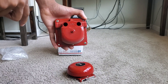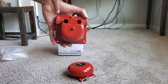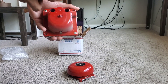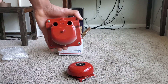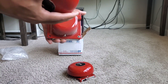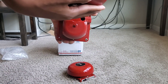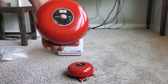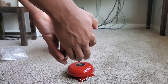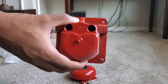The chime assemblies can also fit on this as well, that's why that's kind of there. Once you're done mounting this vibrating mechanism — which mounts on a double-gang 4x4 back box — it's as simple as putting the gong on top. I put it on backwards — there we go, slides on there — and then you re-tighten the flathead screws on each side and the bell is mounted up just like that.